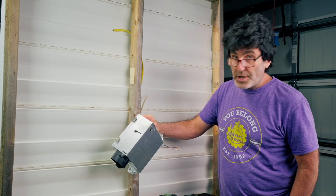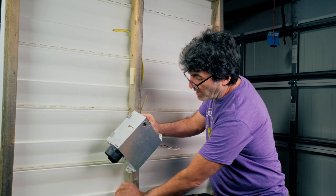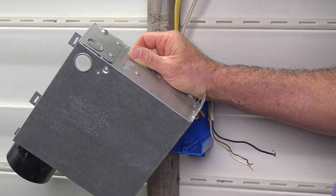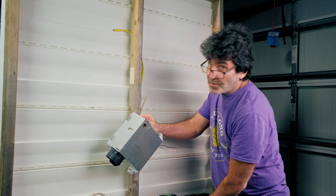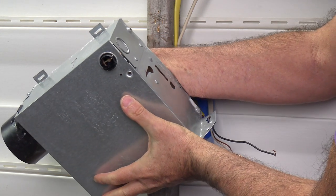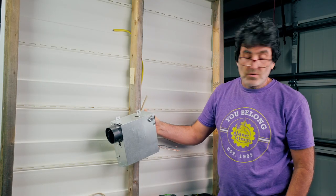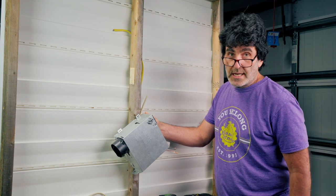Number nine is one I can't tell you how many times I've seen. You'll have a metal gang box, a pot light, a can light, or a bathroom fan — a metal box — with a wire running right through the hole with no protection. Usually it's just raw metal and they've got the wire hooked up inside just like that. Don't do that. Use a plastic connector like this, which goes from the inside out. Or use a Romex-style connector with a nut — tighten the nut on the inside. Don't just run your wires through the bare hole; it's just not good practice.